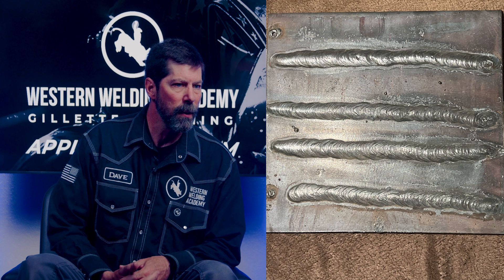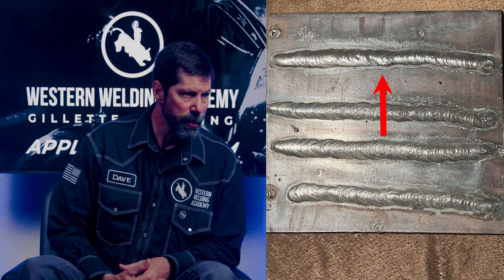All right, I see Fernando. He is 17 and he's giving me some stick welding. Very nice. I see a couple of spots where it looked like you changed your speed a little bit or maybe went a little faster and took some bigger steps. You're not getting out of control. I'm not seeing a lot of undercut there. You did clean your welds up nicely. I'm not seeing any overlap — I would like to see each one of these beads a bit closer to show that you are actually giving me some overlap so you can tie the two in together. You're not long arcing. I'm not seeing porosity. I like what you're doing — keep doing more. We like welds like this.